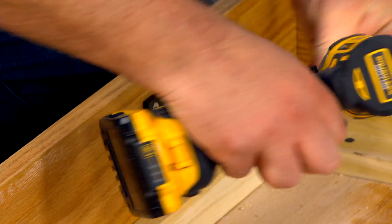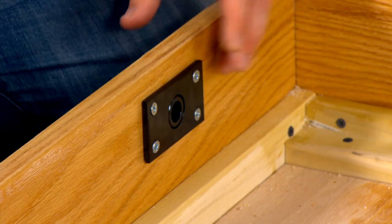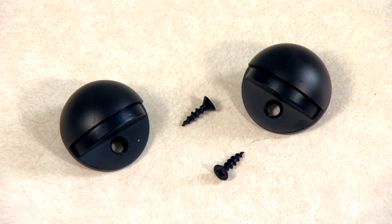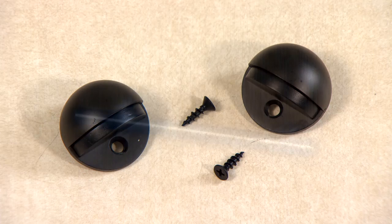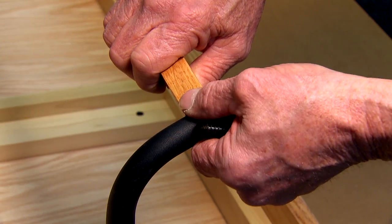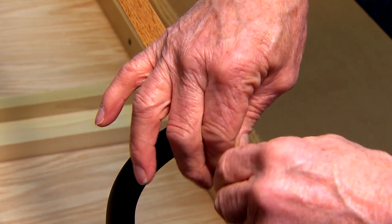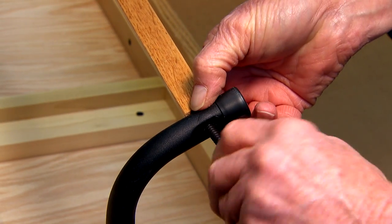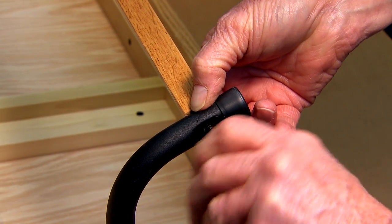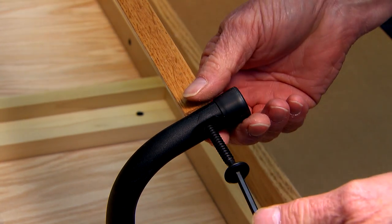After you have sanded and finished all the components of your Murphy bed, reinstall all the Murphy bed hardware except the two domed bed stops. Reattach the decorative handles or pulls on the bed face panel. Attach the leg support rail, part I, between the metal tubular legs using a number 4 Allen wrench and the two 1/4 inch by 2 1/2 inch leg support rail screws.